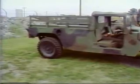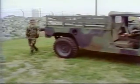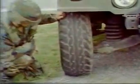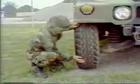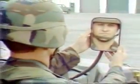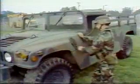Starting with the exterior, walk around the vehicle and visually check for damage or evidence of tampering. Look under the vehicle for leaks such as fuel, oil, coolant, or brake fluid. Visually check the tires for underinflation, leaks, cuts, or other damage that would not allow vehicle use. Look at the mirrors to ensure they are serviceable. Lift the hood and ensure the hood prop rod is securely positioned in the hood support bracket.